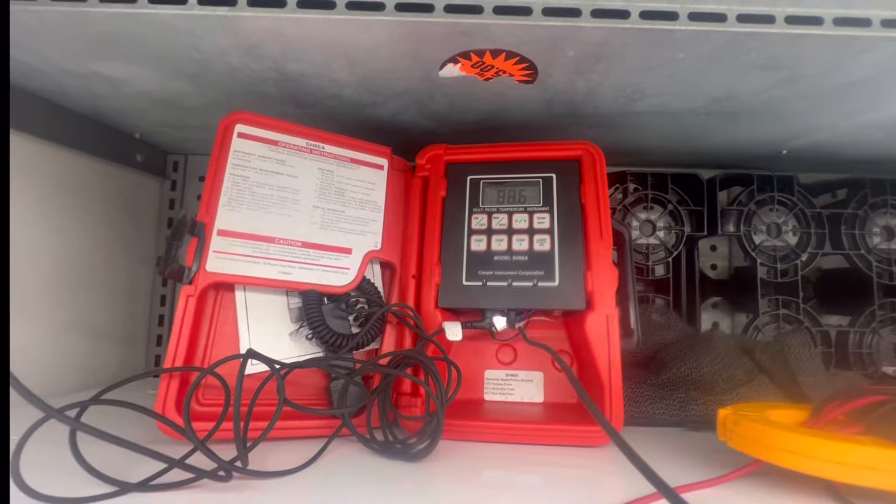I'm going to go to my rack just to make sure everything's running and then pump it down and change it. Tight space back here. This is our circuit — this is our suction line right here. It doesn't feel that cold, and it ain't sweating. It should be — these other lines are cold, they feel cold.